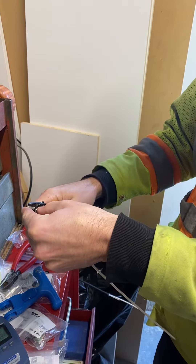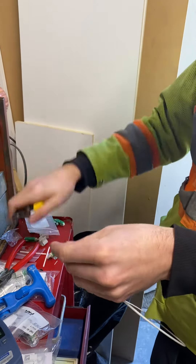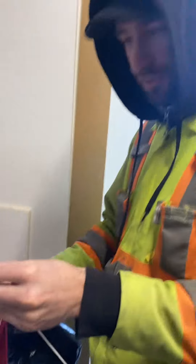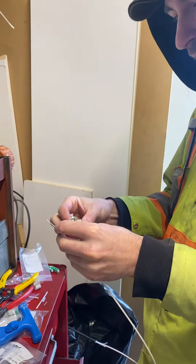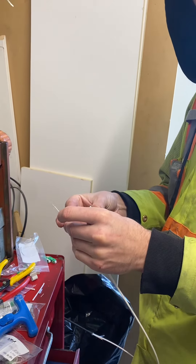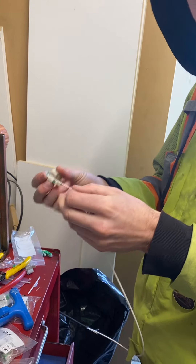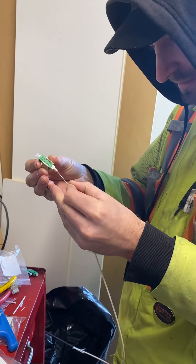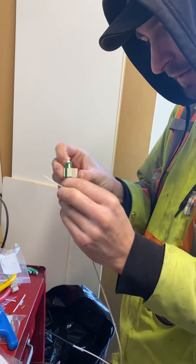Right now you're peeling off the coating. Exactly — if you don't take that final coating off the wire, even once you're stripped back to the fiber, without pulling off that final coating it won't make a good connection. You have to use specialty pliers to get that coating off, because it's a really tight tolerance to get something with the right size that'll pull that coating off.